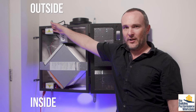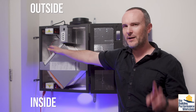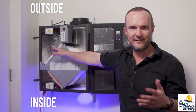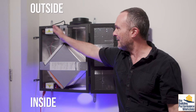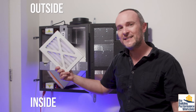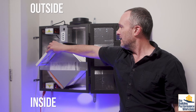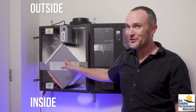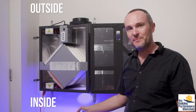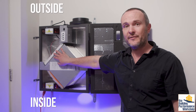Outside being here, there's a fan on this side and on this side. This fan draws air from outside — the dilution air that we're talking about, which is not always fresh, by the way. If there's a forest fire nearby or a lot of traffic or pollution today, it might not be as fresh as inside. But air comes in through this very nice filter, which deals with that freshness issue. This is a MERV 13 upgrade available on these Renew Airs — not all brands have that as an option. Then it goes through the energy recovery core and into the house, distributed either into the central duct system on the return side so it can go through another filter.